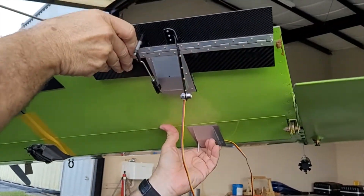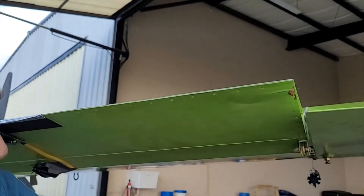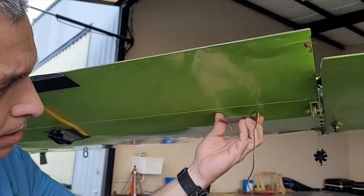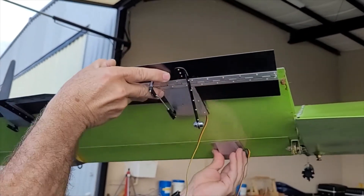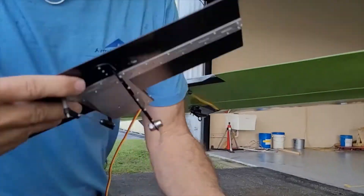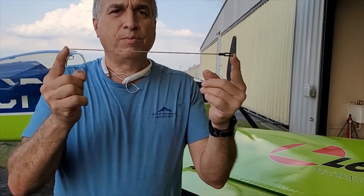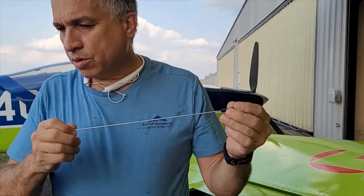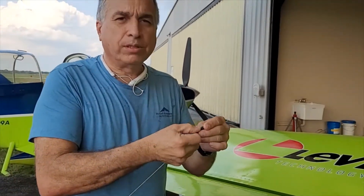This part faces forward, and then you can put the trim tab here. If you do that, you will need a longer push rod — we can provide that if you need it. So let us know what kind of installation you want and we can provide it with the right components.